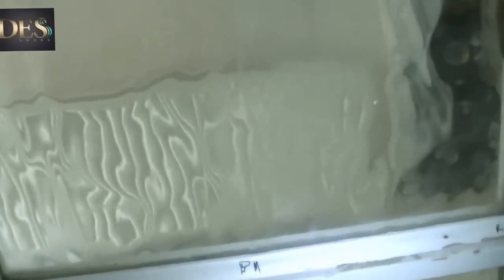So here inside, you can see what I've done before I took each one of them off, because it's three of them, I marked the beads. This bead says bottom middle. The top one says top middle. And on the side beads, I put top of the bead and bottom of the bead. Now, because I had three glasses and I want them to go back into each other, at the top one I marked number one, two, and three. So this was right number one, this one is right number three, and this one is right number one, right number two, and right number three, and so on all the way around, so that I put the frames back where I got them from.